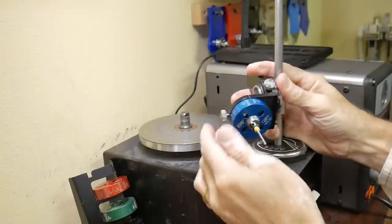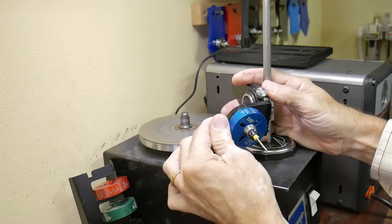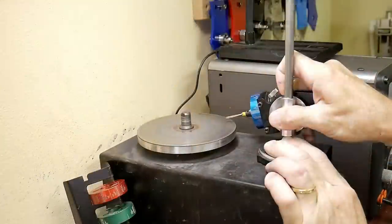You can see here it only takes a quick swipe to get a perfectly polished heel. You do need to remember though that if you're inking your engraving you really don't need a polished heel — I only use this where I want a really bright cut.